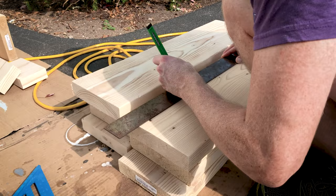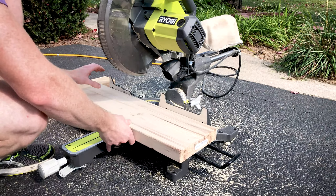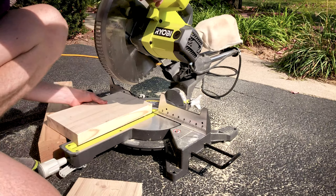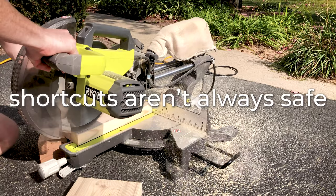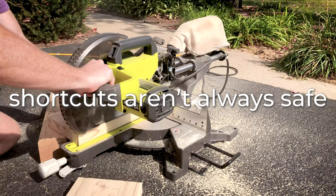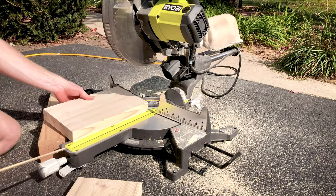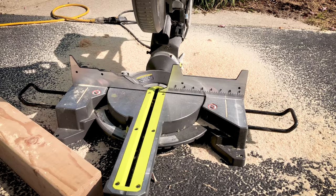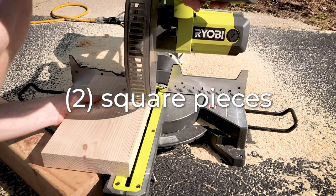This will ensure all 10 of these pieces are the same width before I square off the second side. First, I'm going to make the cross cut. Then I would typically advise making the rip cut with a table saw, but since my miter saw is big enough to make this cut, I'm going to take a shortcut. Now that I have 10 pieces sized 12 and a half inches long by 7 inches wide, I'm going to square off the opposite side by measuring 6 and 3 quarters inches, and this will cut off a quarter inch making each side perfectly square. But I'm only going to do this twice because the other 8 pieces will have one end meeting at the corner.